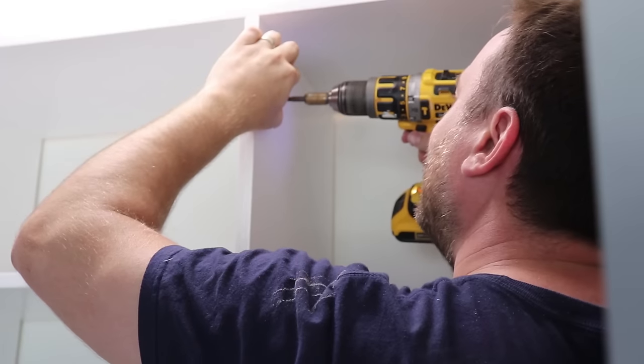When I build a closet, I like using heavy-duty, ultra-robust hanging rod sockets. I picked these up at the store — I like them because they're metal, heavy-duty, and white, and I've never had a problem with them failing. This is what we're going to be installing for our clothes to hang in the closet. I've marked everything and now I just have to screw it in. I already did the other side, so now let me just put the rod in. Done. Now I have to do this two more times — one for the bottom and one for the other side — and then the closet will be complete.